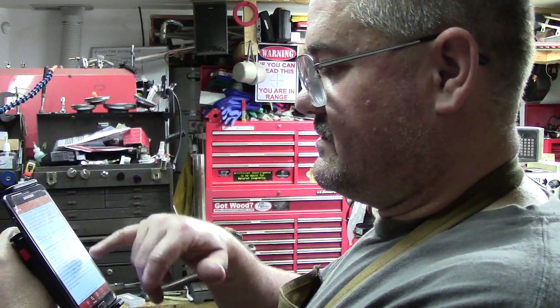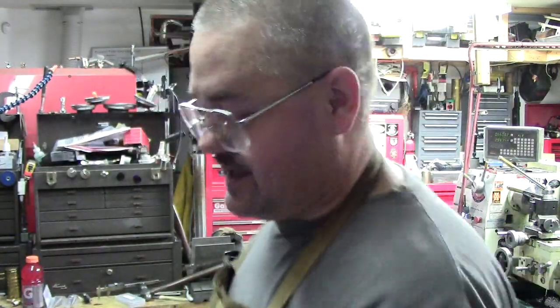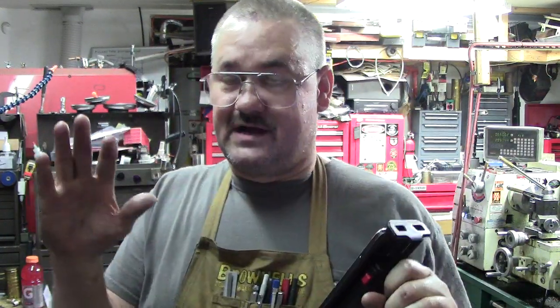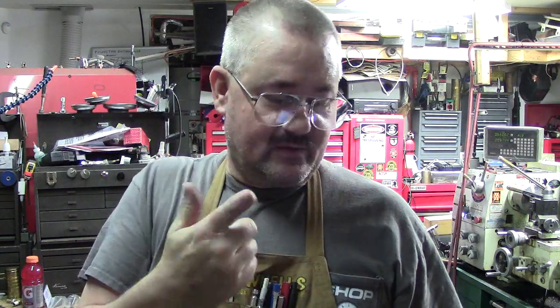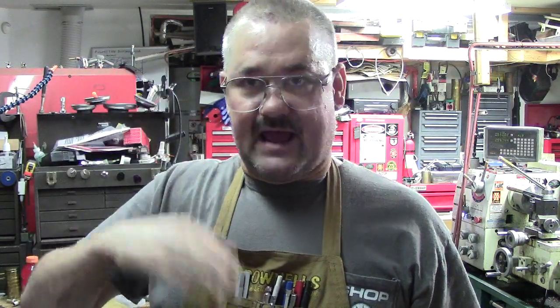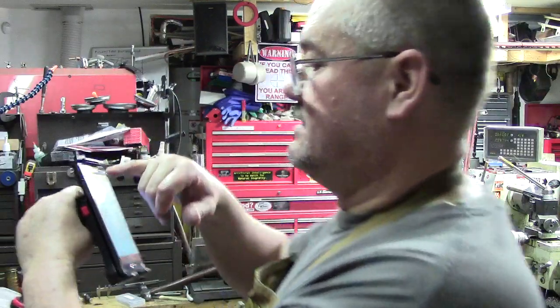Hardening, and of course they tell you everything, and this is what I go by. You can't remember everything, so even when I get ready to do it, I'll pull this up again, because you don't try to remember everything unless you're doing the same metal over and over. On my oven, which is the HT1, you can program in your recipe: how quick it builds up, I like it as quick as possible, the heat, soak, and cool down time, whether you're going to let it cool naturally, according to whatever material. That's why I love this app so much.